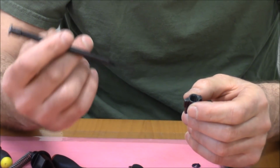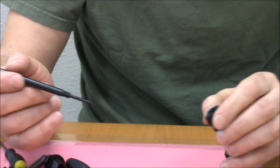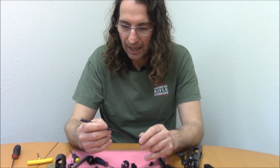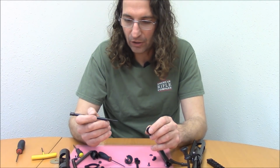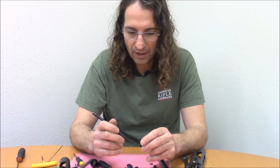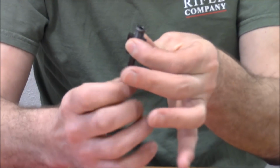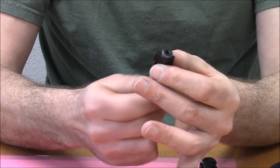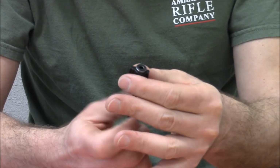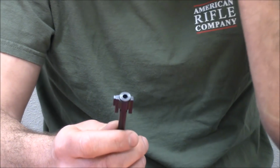The pin and the spring for the short action is 55 grams. I think what I'm going to do is have multiple springs available. We'll probably start with 15-pound springs and then maybe do a 17.5 and an 18. But I think 15s are going to be adequate. I think you'll find that they will keep the cocking forces very light, and they will reliably ignite the CCI number 34 primer. So the firing pin passes through the cocking piece like this. They're screwed together, right? That's a 3/8-32 thread, really fine. And the firing pin has a head basically on the end of it, which prevents it from being screwed all the way through the cocking piece. The reason I like this design is the same thing that I've been doing on the Mauser.